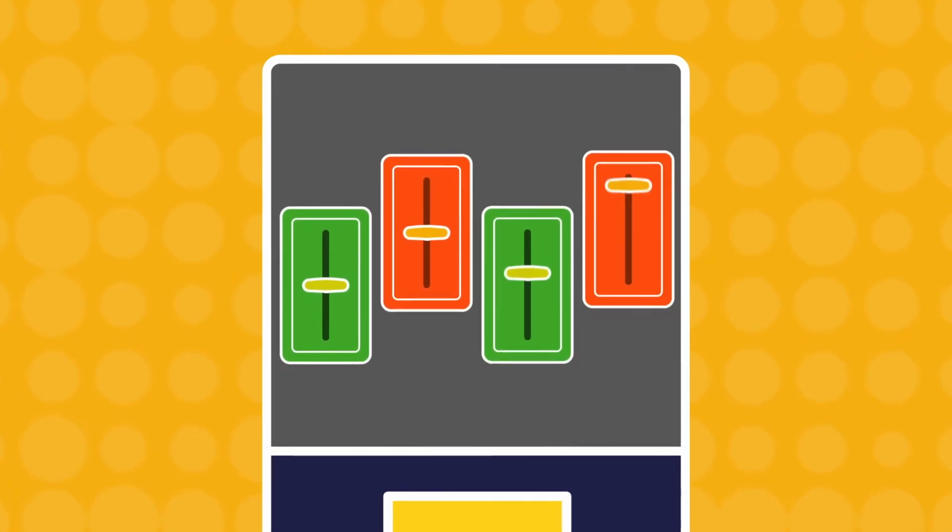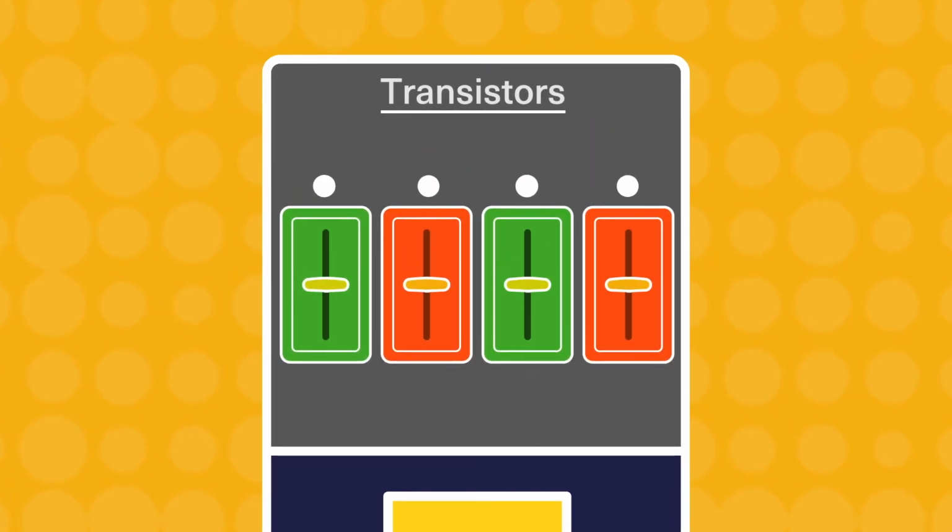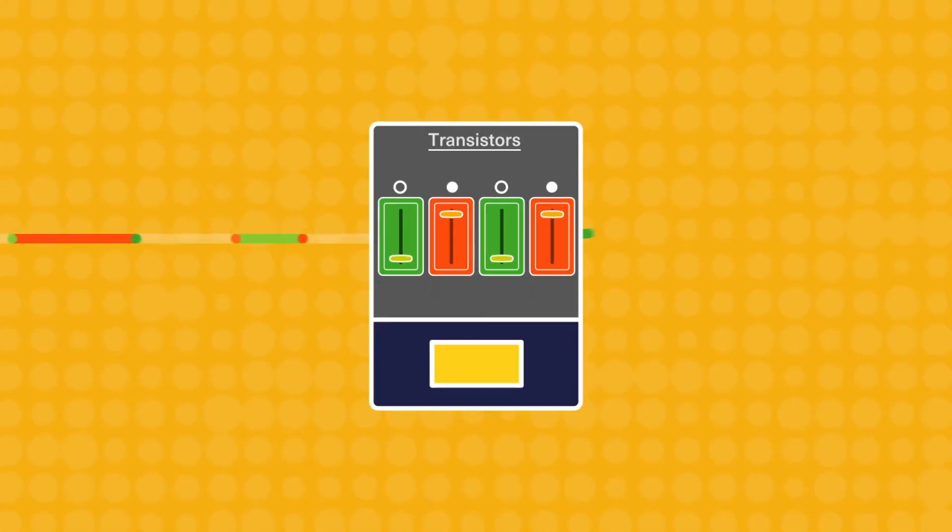One way to understand how an inverter converts power is to imagine it being two pairs of switches, which are called transistors. The transistors are paired so that when 1 and 3 are closed, then 2 and 4 are open. Each pair will cause the current to switch directions when closed.